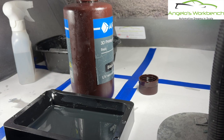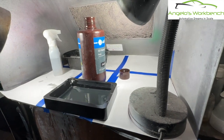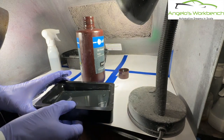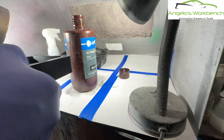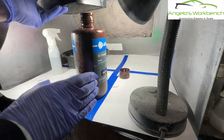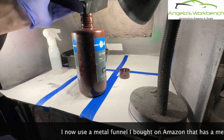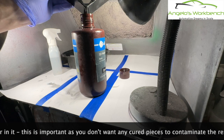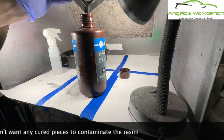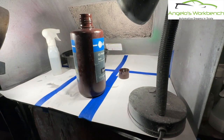There is a pour corner to pour the resin back into the bottle, which is what I'm doing right now. You want to do this every time when you're done 3D printing — you don't want to leave resin in your printer for long periods of time. Some prints take a long time; the big piece of the body took 5 hours, just because I have a slow printer. There we go — all of the resin I could get out is back in the bottle.